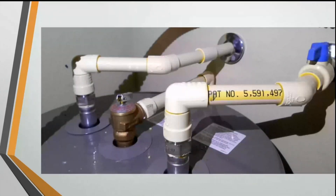A couple of pictures to illustrate why this stuff can be problematic. Number one, just coming out of this water heater, there are eight fittings within about two feet of piping. Every one of those fittings induces pressure drop into the system, but because it's a rigid plastic pipe, this is how you have to install it.